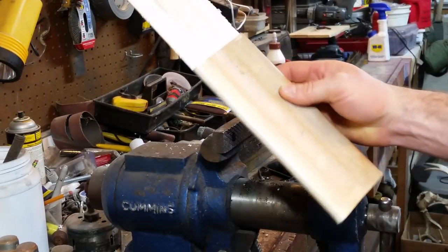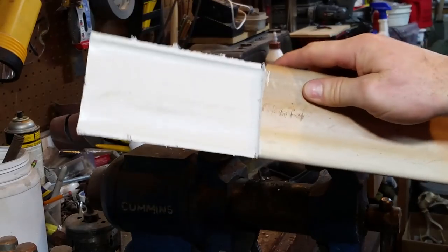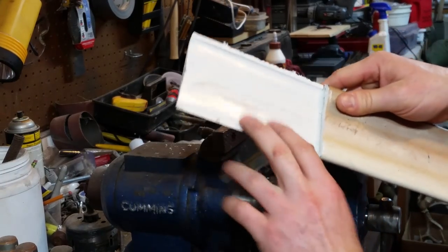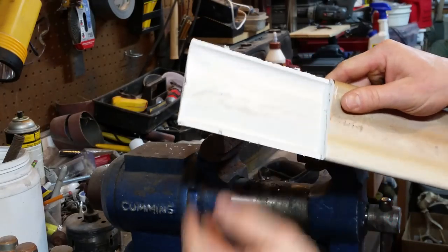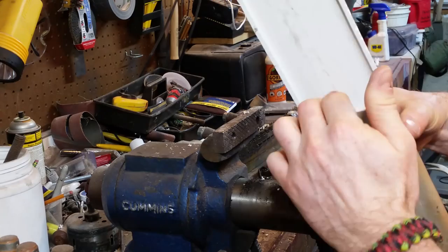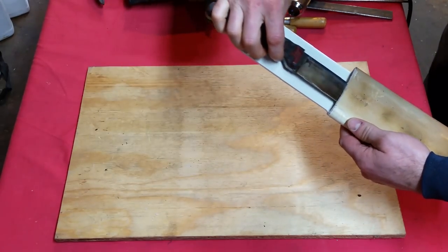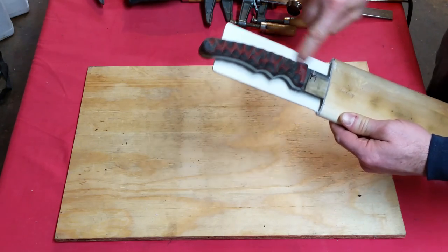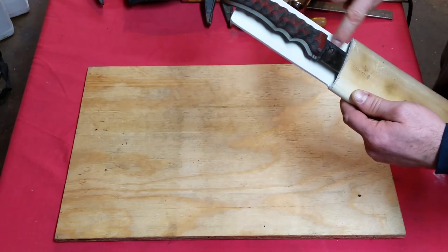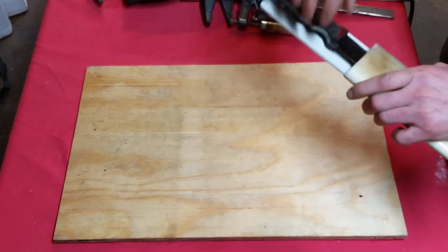There's what we have so far. I can use the belt sander to shape the sides, and that's the tab I'm going to use to bend over and make the belt loop — it'll bend over and touch to form the loop. I can get this the proper thickness so that my blade fits well with the handle thickness. Everything fits good until about there, where it gets pretty tight. So I need to warm up the piece that's going to be the belt loop, bend it over, and then shape the back of it — I need to give it a little bit of a dip to fit this.